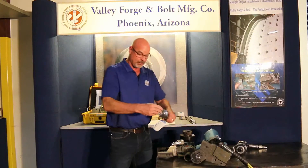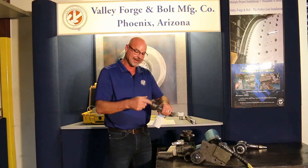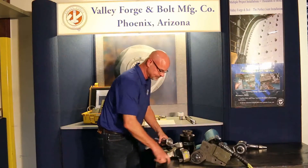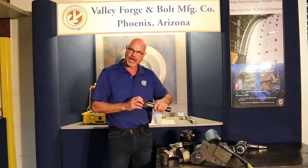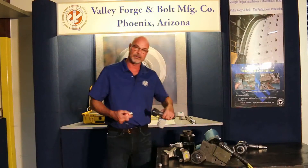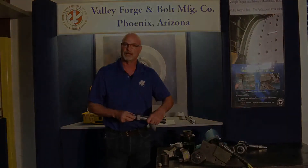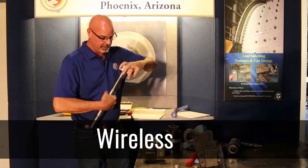You're going to have to always protect the cap so that you don't damage that datum surface area. Then you put your tool on with your socket and torque from the head side. You torque it up, then recheck it to make sure it's reached the right load reading. If it's not at the right load, you do it again until you get the right load on the SPC4 424. You'd also like to use that in a wireless version to monitor your fasteners.